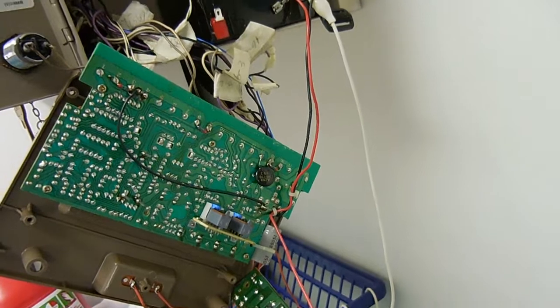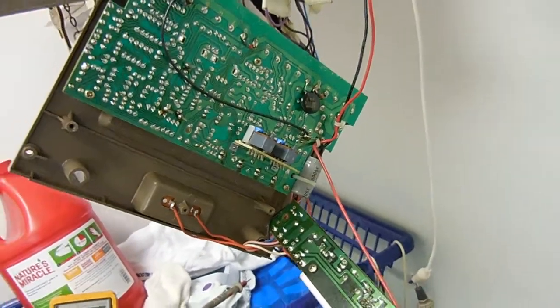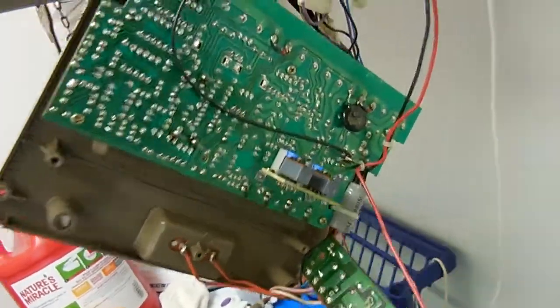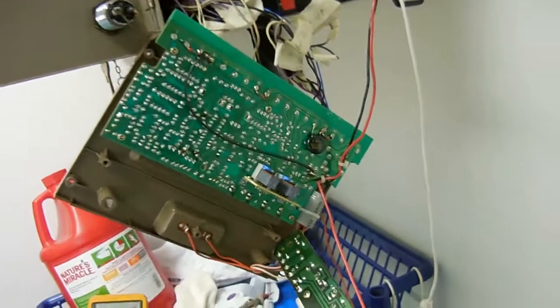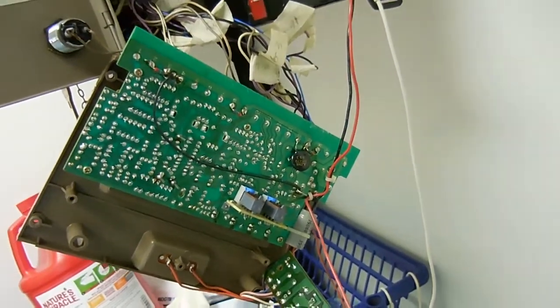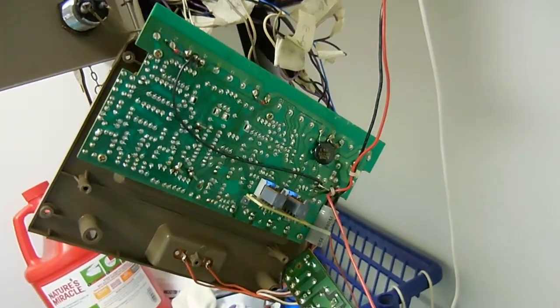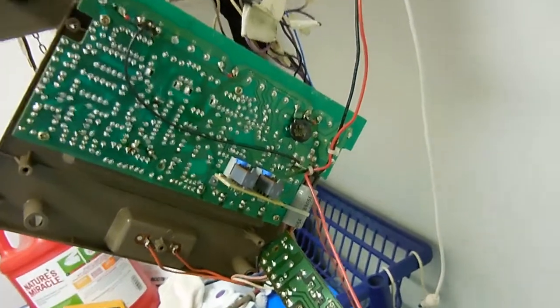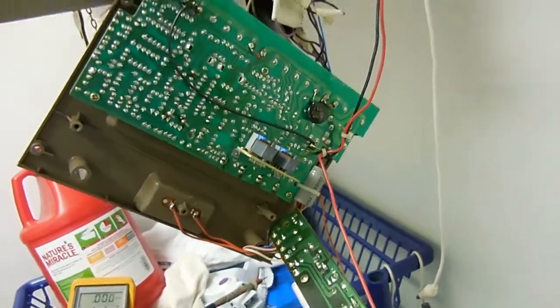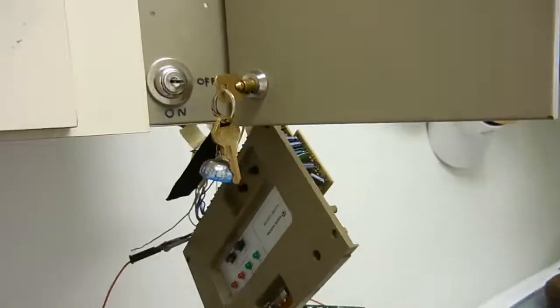And I ordered a new battery, and I put it in, and I did the basic checkout, removing AC power, to make sure the battery backup would work. But what I didn't see is an increase in voltage when I removed AC power. And I just started digging, and something just didn't feel right. All the switches did the right things, but there was nothing on YouTube or anywhere about this problem. So, of course, the thing's in pieces right now, which is no big deal.